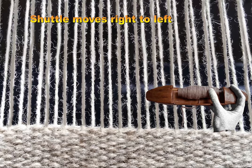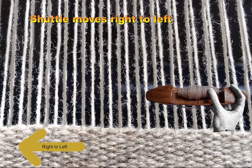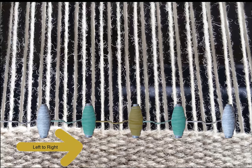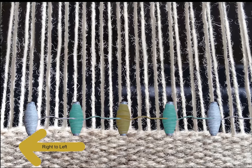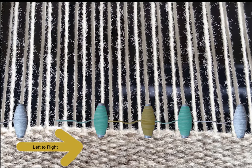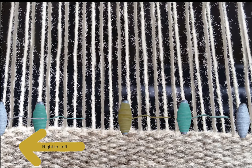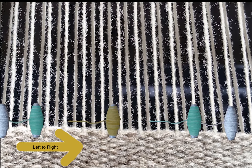Our shuttle throwing process is one we're already familiar with. We pass the shuttle from left to right and right to left, back and forth, over and over, building up weft layer by layer. We can imagine replacing a shuttle by moving all of the spools simultaneously back and forth. But we can't move spools simultaneously, so we have to move them one by one. To do that, we have to move them out of each other's way, moving the spool that isn't already at the edge to the edge first, then moving the next spool to where that spool was, and then the next spool on down the line.